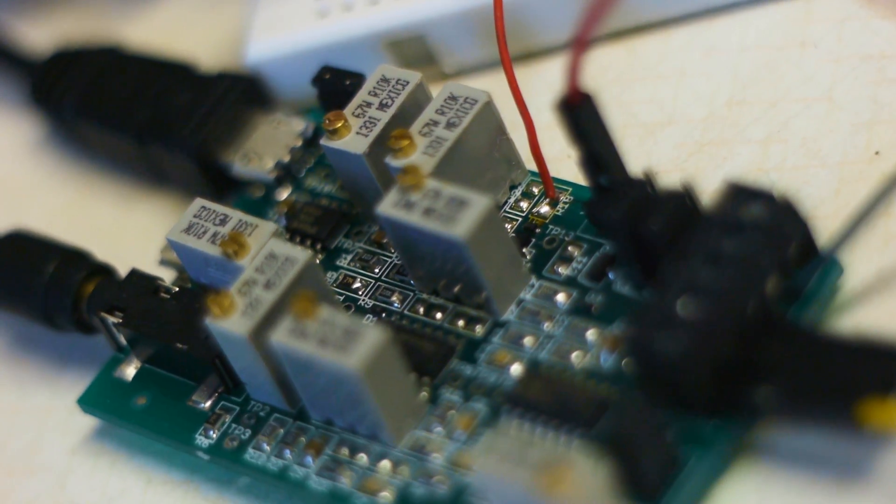This is the circuit we have right now. It will turn the laser on and off in both DC and AM mode, and it turns the mirrors off in AM mode when the signal goes away. There are a lot of adjustments on this one — eight in all — and they all interact, making setup a painful procedure. We've got it down to two pots now, which makes it a lot easier for you guys and a little cheaper for us too.